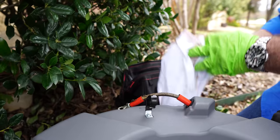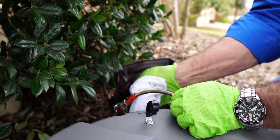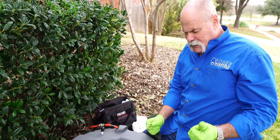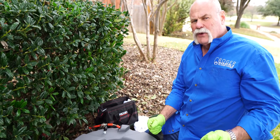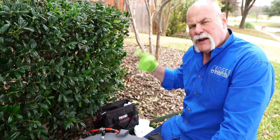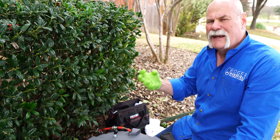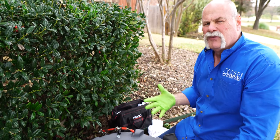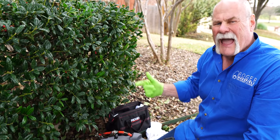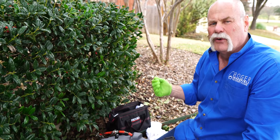Once I get down into here, I want to very carefully clean my cable. I want to make sure I don't have any gunk on it because I want this cable to last a long time. This did good for me today. This is something you can use as a sewer machine or even as a cleaning option. The chain knocker literally scrubs the inside of the pipe as it goes around — any grease, any sewage, anything that could be built up, maybe old toilet paper, maybe soft stoppages, this is going to clear those up really well. If you turn on the water inside and let everything flow, it will literally wash it down really, really well.